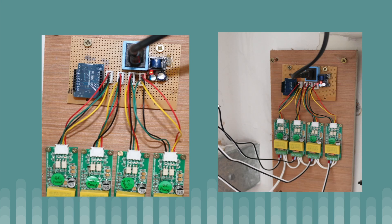Here are some pictures of the actual setup I have. You can see the 230-volt mains power coming in, going into the transformer and coming out as 5 volts and ground. That 5 volts and ground powers the ESP8266 while also powering all four of these boards. It's quite useful how it's done as it's a straight track, saving a lot of wiring. We use pins D3 and D4 of the ESP8266, which are the two pins right next to the ground and 5-volt pins.